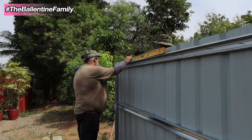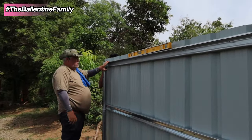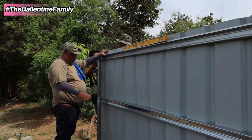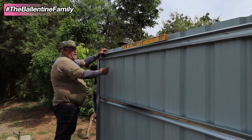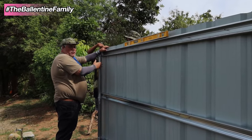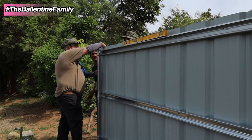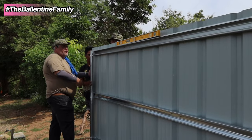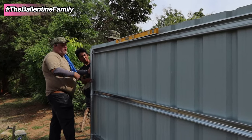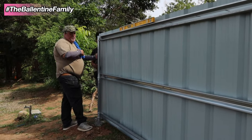On the last panel, they're all designed to overlap the gaps in the purlings. What we're doing right now is going to put it one over, so when we add on to the fence we just unscrew this panel, slide it over one ridge. That way it'll have the lap over the seam when the next panels go on, but I just didn't want to hang it over too far from the wind before we add on to the fence.